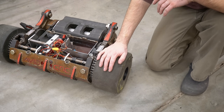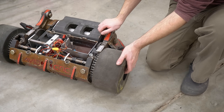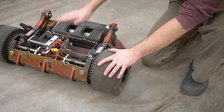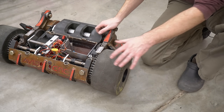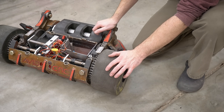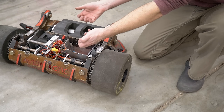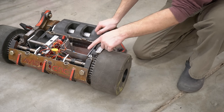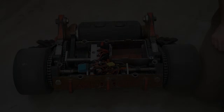Copperhead is all back together. Some of you might be wondering why we don't just undo the bolts and slide the side off — it gets a little tricky because all the weight is resting on this. The body of the bot wants to rest down, and we have 60 pounds up in the weapon that wants to rest on it, so simply pulling the side off is really difficult. You kind of want it vertical and then just lift it off, like what we did. If you have the bot on the edge of a lift cart or workbench you can lift it off the side, but with two people I think this vertical method is the better way to go.